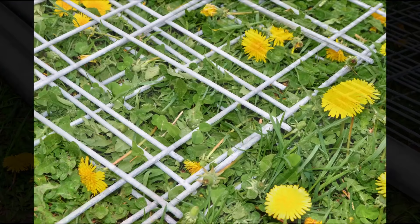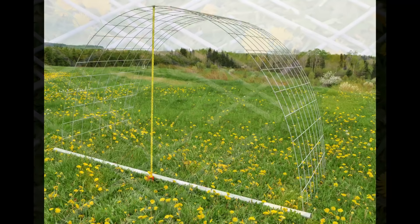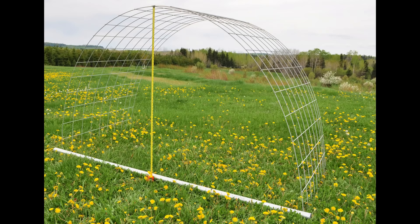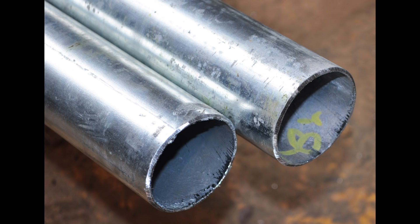The hog panels are also made from galvanized steel so they weather very well. The openings are about 4 inches by 6 inches. We used hardware cloth on the first 3 feet of the frame because small chickens could fit through these openings. I found that bending the 16-foot long hog panel into a semicircle around the 9-foot galvanized fence post was just perfect — just enough headroom to walk around inside. I welded two 9-foot fence posts end-to-end to have an 18-foot long chicken tractor; here are the ends prepared for welding.